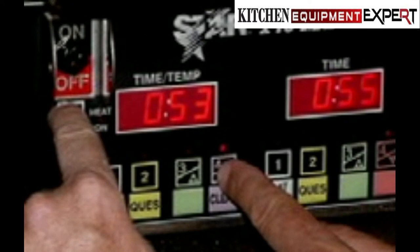To program time and temperature: 1. Press and hold temp — actual temperature displays. 2. While holding temp, press and hold any program button on the left PC board for 1 second. The LED above the program lights and the display reads '_ _ _ .'. Enter the 4-digit security code sequence: 4, 3, 2, 1.